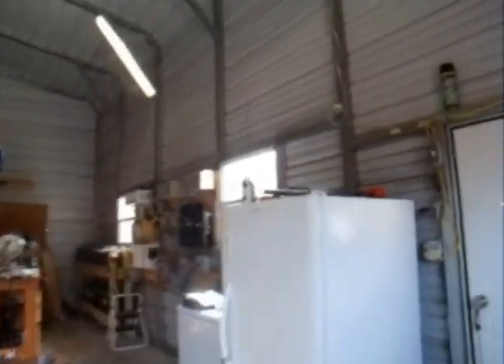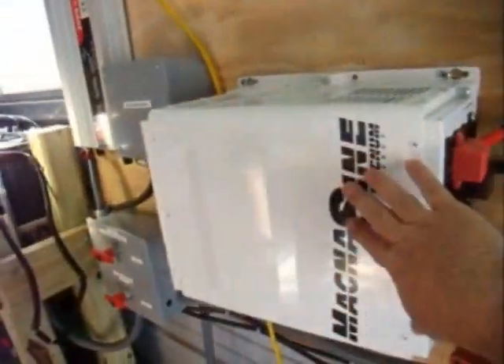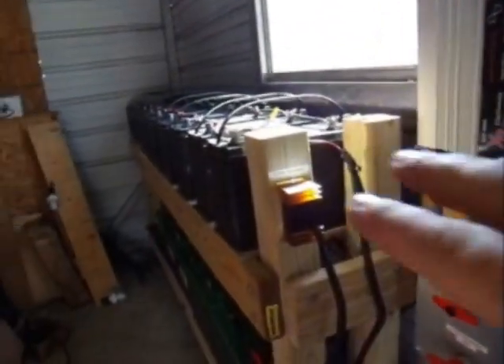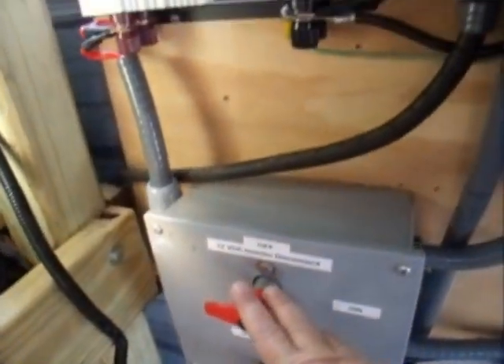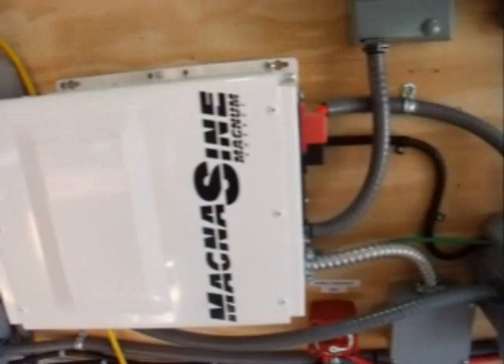I don't have to spend a whole lot of money on automatic transfer panels. Things are pretty much set up the way they should be — I have my disconnects for the solar panels, the ability to switch from this guy that will feed my home to the ones that will feed my grid automatically through the dump loads on those two turbine charge controllers. My 12-volt battery bank also has its own set of disconnect switches. The system has its own dedicated ground system that goes outside to an eight-foot copper rod buried in the ground, so my DC circuits have their own ground separated from the grounds in the home.